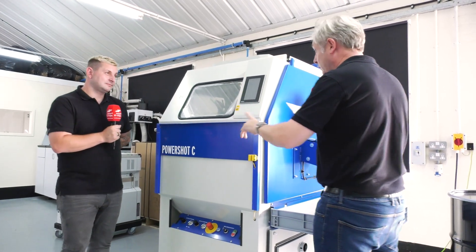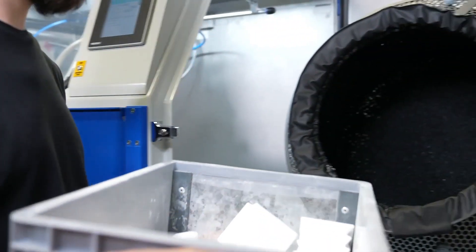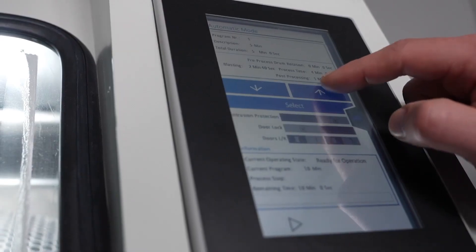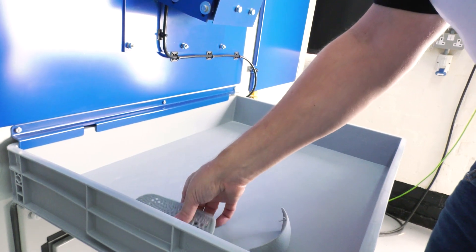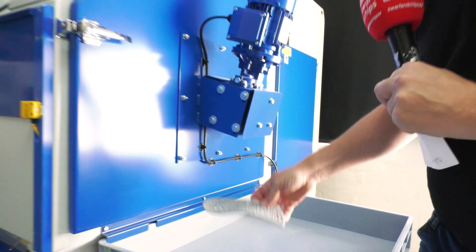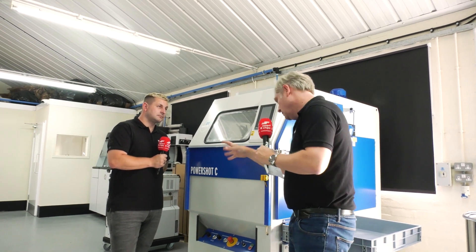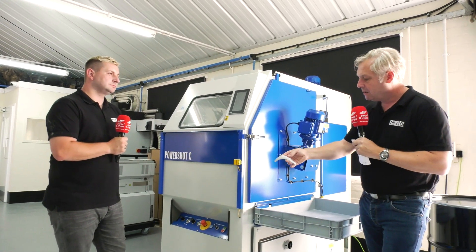So what are we doing over here? We are PowerShot C-ing it, which means in layman's terms you are giving it a final clean. It depends on what sort of finish you want on your components. The PowerShot C is essentially a washing machine in very basic terms. For smaller components, you pop it in there and it's blasting really fine medium at the component to give it that surface finish. That's an insole — great example of the surface finish after it's been cleaned. For larger components that might get damaged in the tumbler, you can manipulate the part yourself using the hand ports with gloves.